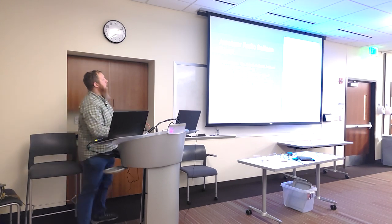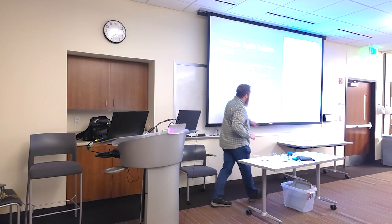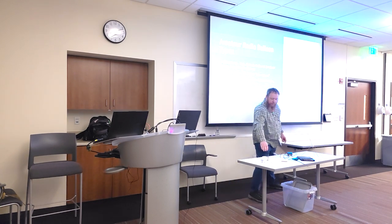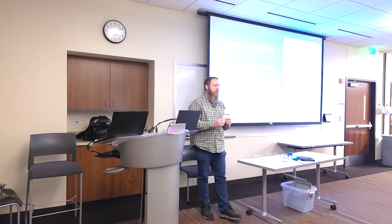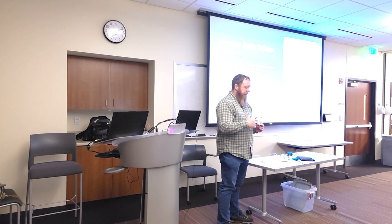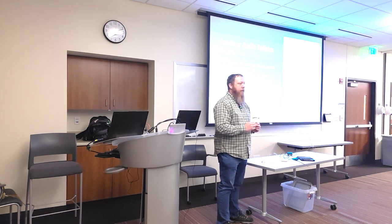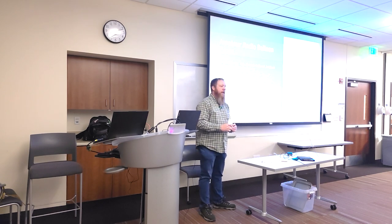All right, so I launched these with the students, and this little white thing right there is this guy. We just reprogram it so that it transmits APRS in the 70 centimeter band, and then I just attach it and we use it as a tracking item with the rest of the balloon. In the orange box, there's another APRS transmitter and a satellite tracker, but this is just a tertiary system to be able to track it.